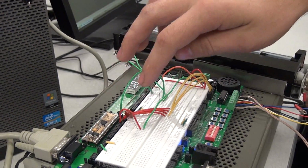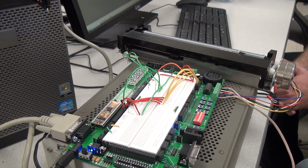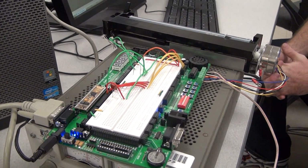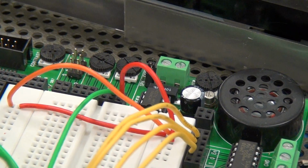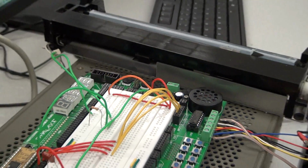This is our capacitor that we use to time the actual, I guess, motor position. Well, the motor position command, which is on a variable resistor over here. See it? Right here. So there's a variable resistor over here on the board, and what we're really doing is measuring the position of that resistor in order to determine where the carriage should go.